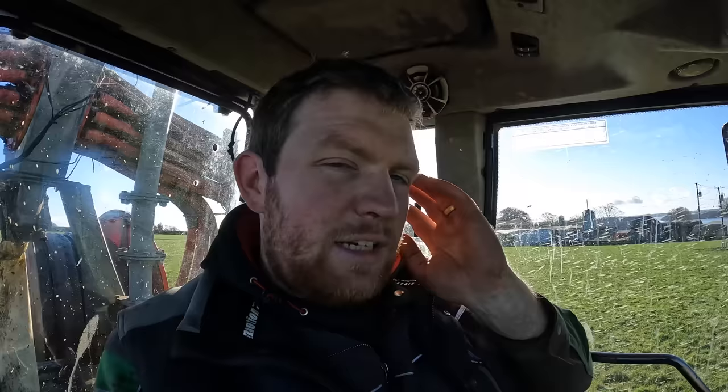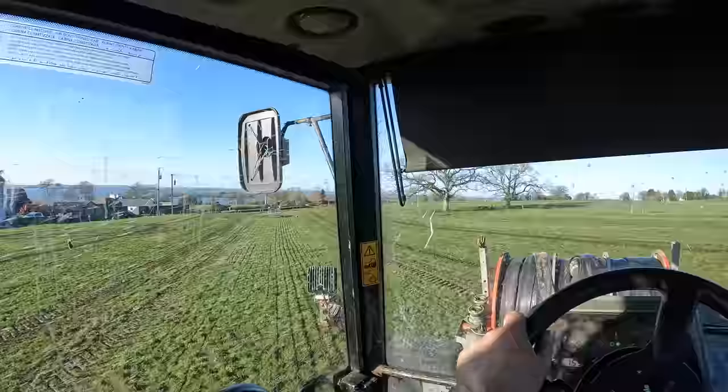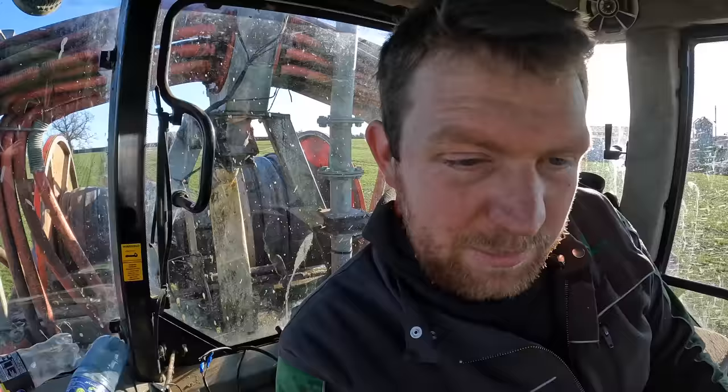That's us finished. Just getting air there now. I've just got to straighten out the pipe back down there so I can roll up my two sections. It was a bit inconsistent — just coming out of some droppers and not others. We'll get this pipe rolled up. We've just started putting water in the tank too, so it has improved a bit. It's a full relay rejig down the other way. Happy days — 1.72 hectares in the first paddock.